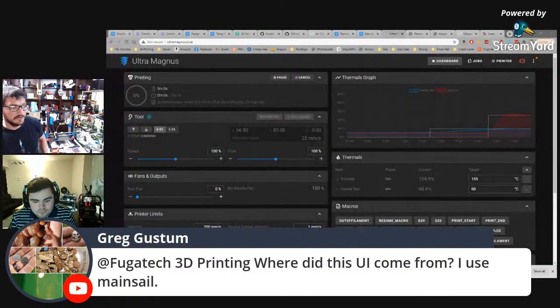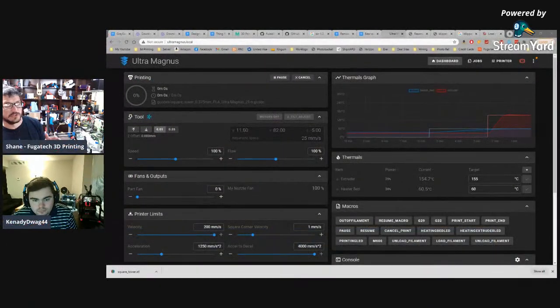Yeah, which again, I do like the level of control here. I also like the transparency of the print because, again, you print in Marlin and you're like, oh, I set my print to 150 millimeters a second. You ain't printing at that at all. Because also, you have zero way to verify that in Marlin. But with this and with Duet, they both have that live on it. Now, this one only shows requested speed, but Duet shows requested speed and actual speed.